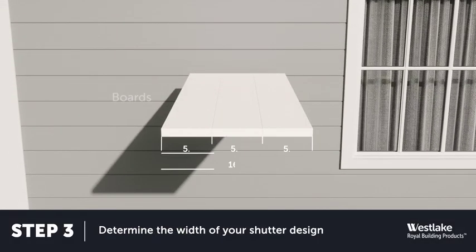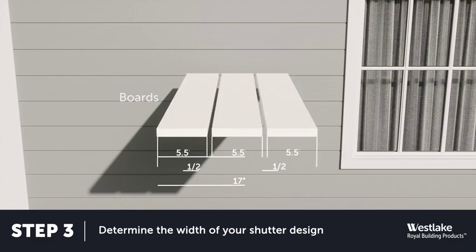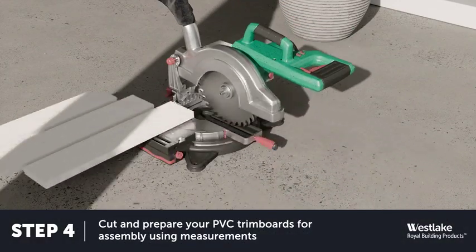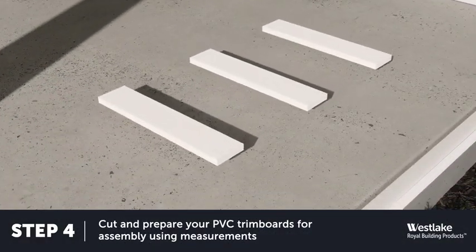Next, determine the length of your battens. If your shutter design uses boards that will be flush, simply multiply the width by the number of boards. Now, make all the battens you will need. For each shutter, cut 3 1x4 trim boards to the width of your shutters.